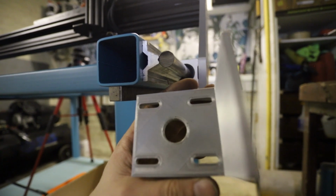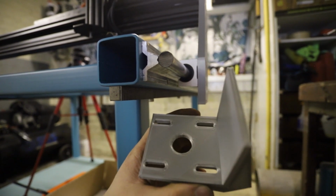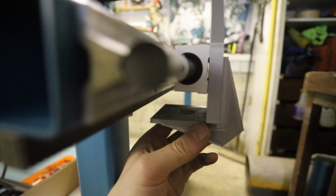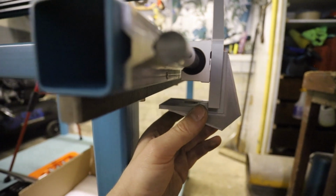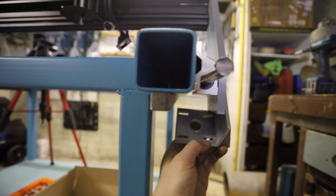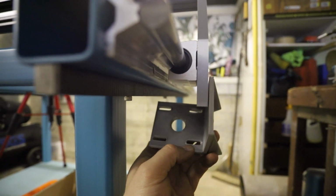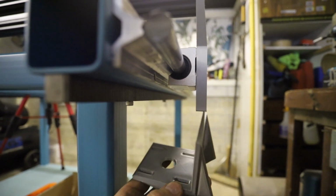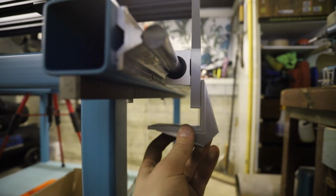So all the elongated holes, they're good and they will work for changing the size or the diameter of the pinion gear. However, I noticed that I hadn't allowed for them to pass underneath the end of the gantry plate. But in this particular instance, it's not going to be an issue because, as you can see, I've got loads of space between the actual hole itself and the rack itself. So I can redesign that in CAD so that all this bottom plate is moved further over this way, and also that means that the elongated holes will miss the bottom of the gantry plate.